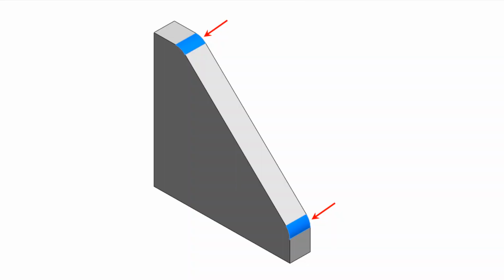By doing so, this will create an edge that's not only easy to weld, but also less susceptible to melting away during weld out. Don't forget that when using the blunt edge approach, don't forget to round these 2 sharp edges of the gusset. The third thing to avoid in gusset design is no clearance for weld or corner relief.